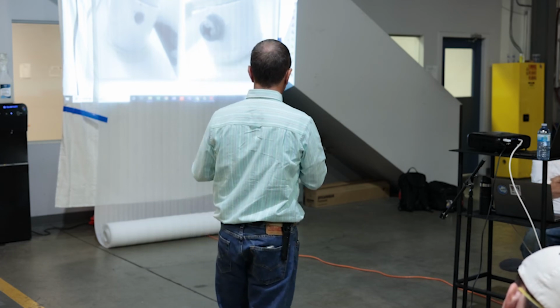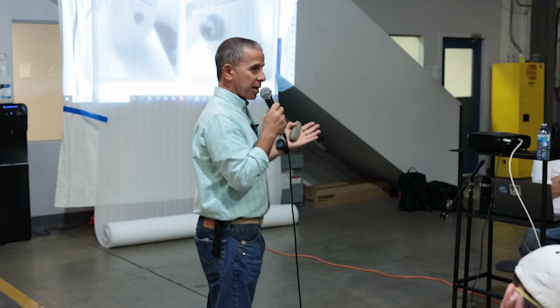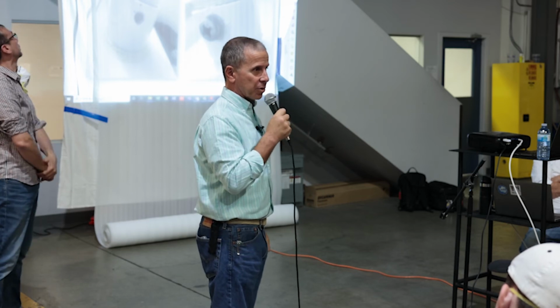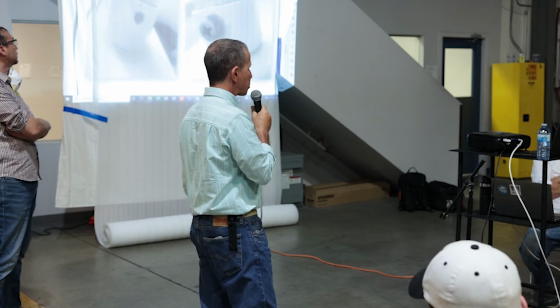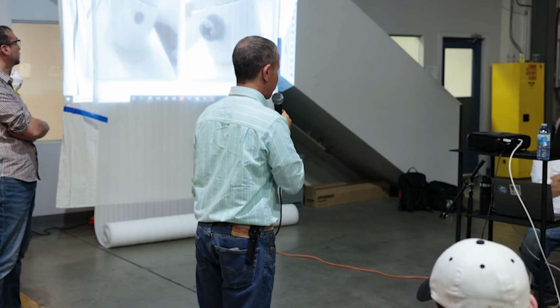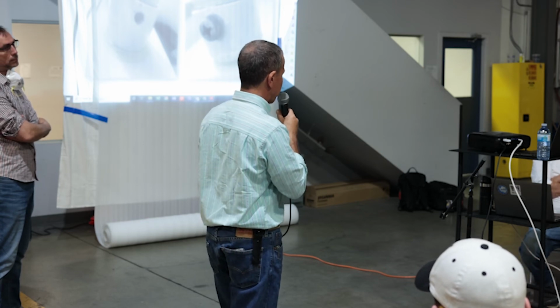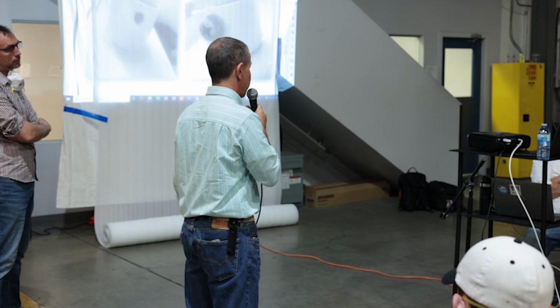So those are hard to prevent, but in cases where you've done everything you can, and then you begin to have paint failure for some other reason, again, catch it early, and it's a touch-up with a little artist brush. Wait 6 months, and it's a blister that's 6 inches in diameter. So that is part of your owner's manual literature, to tell people to periodically inspect for damage to the paint and touch it up where it has occurred. That will minimize failures of this sort.